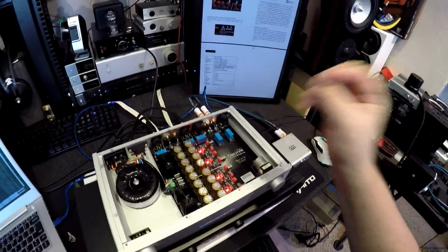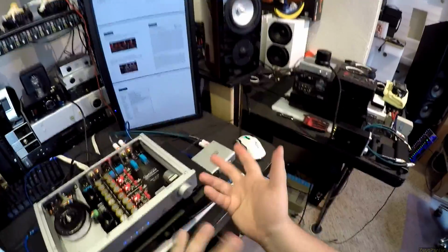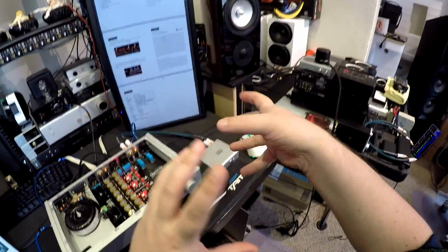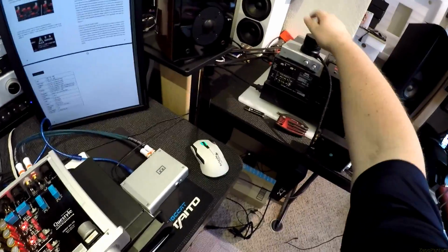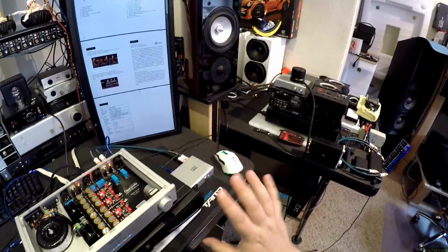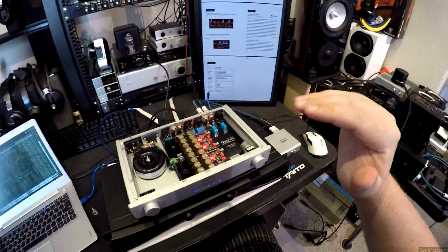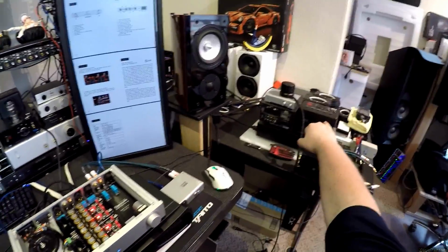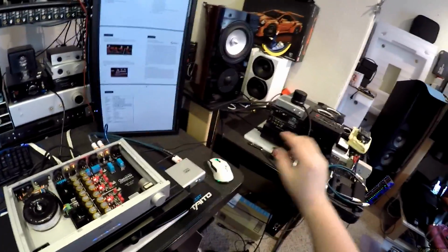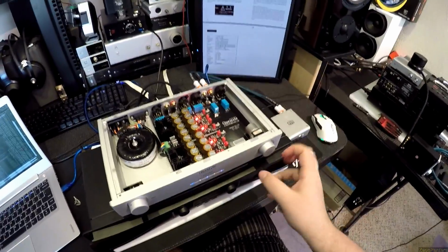Total harmonic distortion plus noise. Because a volume knob, every volume knob is gonna introduce some problem. It's always gonna introduce. You're taking signal away. You're messing with it. And passive ones like the Sys and this are going to do, I'm going to say, good enough because it's 98% of the United States and world population. That's good enough. The DBX might be a little bit cleaner because it's digital, maybe, because there'll be no channel imbalance because it's digital.